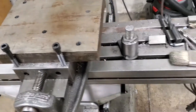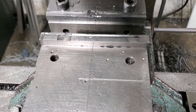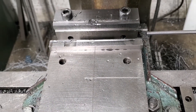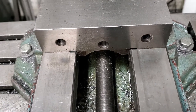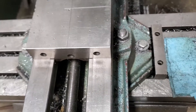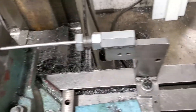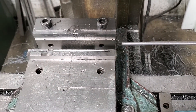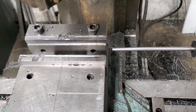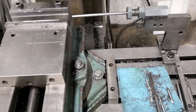Over here is another vise — same idea. It's got a hole on top in the center I use for a big jaw to bolt down, and then I use these already threaded holes in the back. These are metric — this is a newer vise, like a Palmgren maybe. There's my quick and dirty stop I made; it's adjustable, goes all the way through the end of the vise jaws. I can clamp down to maybe five-sixteenths in there.